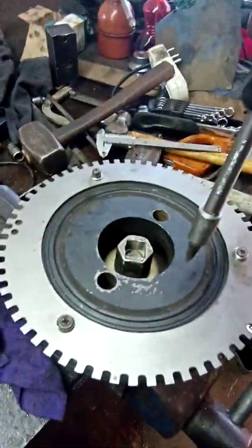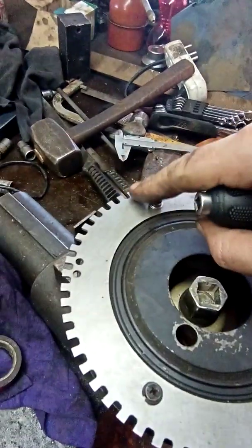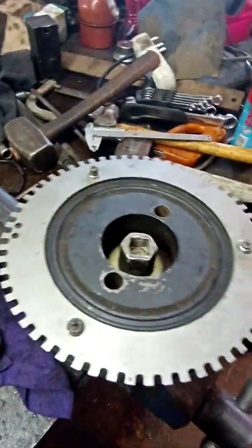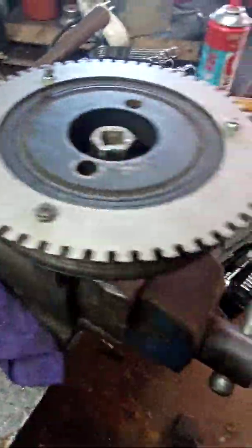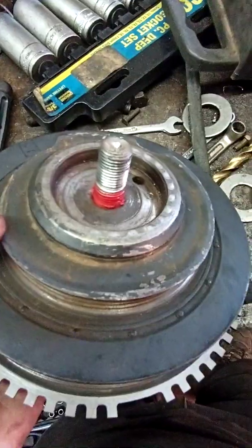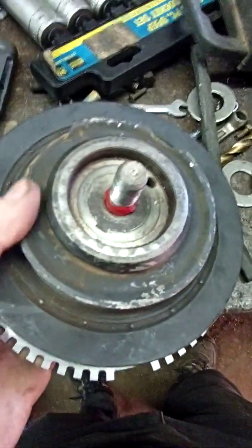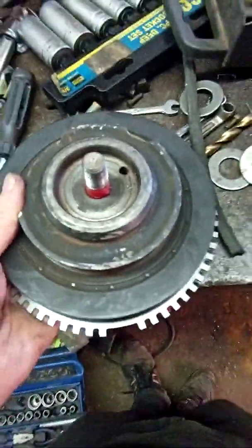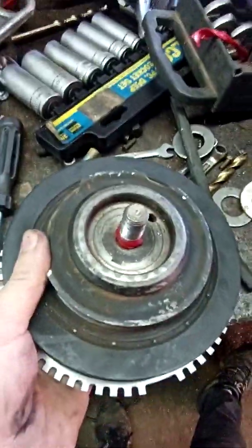Once it's balanced, take off one screw at a time, put the proper one in, weld or tack it, then move to the next — don't take all three out at once or the whole thing comes off. I also added some red electrical tape in there to take up any play in the pulley fit. Be careful there are no bubbles or folds in the tape as that will throw it off center. Just tap it over the washers, put on the bolt, and you're good to go.